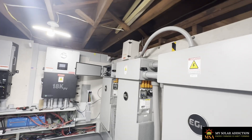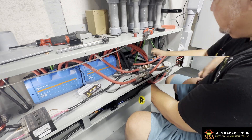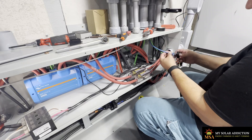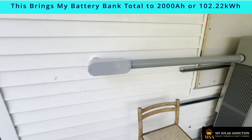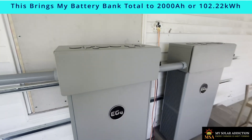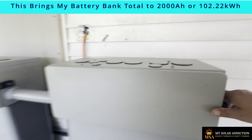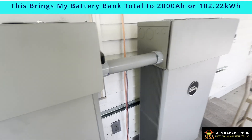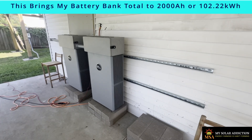I just need to run them through the conduit boxes on top of these Power Pros. I've got my batteries finalized — 2-inch conduit, battery cables, comm cables all running in. All set up, paralleled to the bus bars, grounded. Looking good. And we're set up for a third battery when that happens in the future. Awesome.